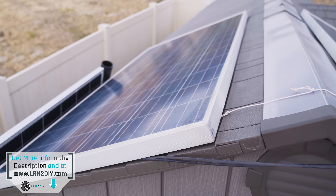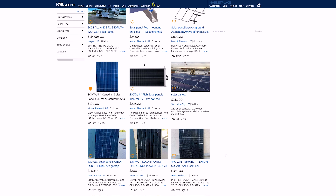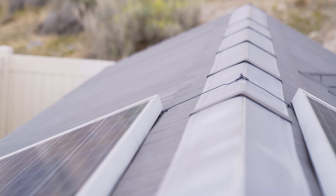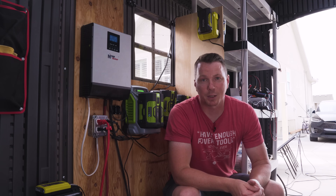If you're looking for a good value on solar panels, I'll put some links in the description, but it's also a good idea to check your local classifieds — you might be surprised at what you can find there. My big struggle was figuring out how to mount these panels to the top of the shed, because this is a lifetime shed where everything is basically plastic and I didn't want to drill holes in it. What I did is just place them up there and use some heavy wires to connect them so the two panels straddle the roof peak. They weigh about 60 pounds each, so they were a little awkward to put up, but once up there they've stayed in place really well. In the future I'll be looking for a more permanent mounting solution, most likely involving some mounting rails.